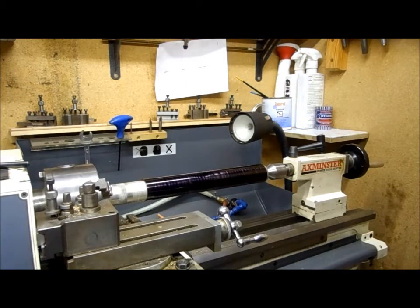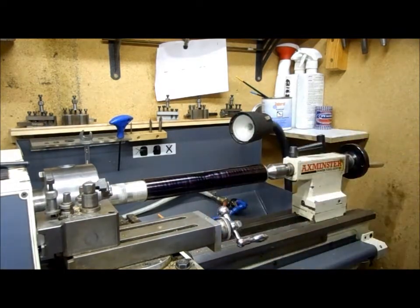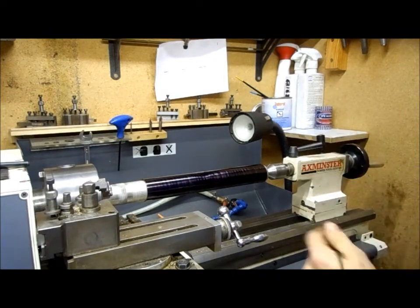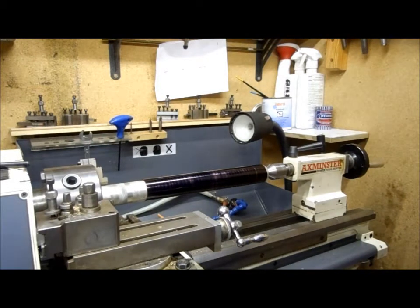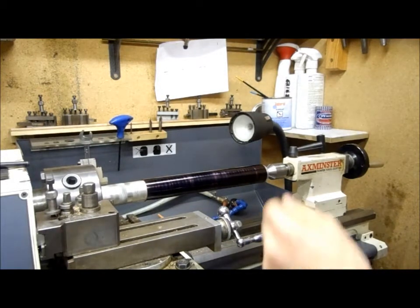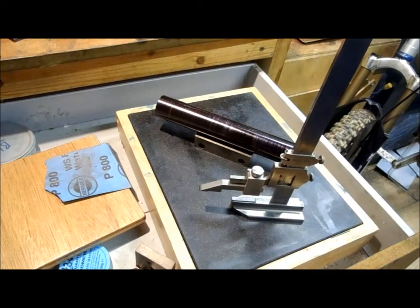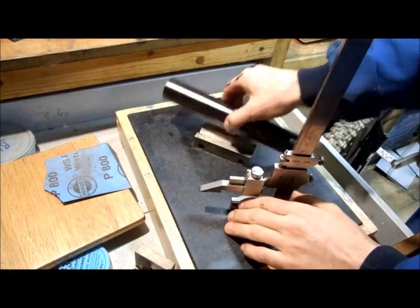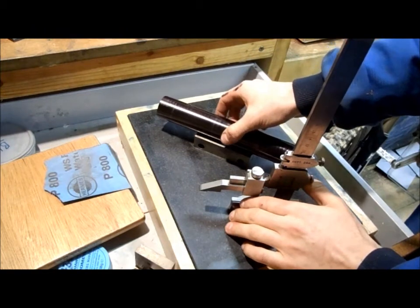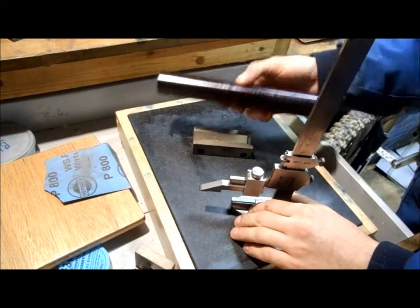Right, that's nice. Now I can mark where the holes are going to be from each hole. I can use spring dividers, but first I need straight lines. I'm going to put that in the V-block and use my scribing block to scribe the lines. So now I've just set up on my surface table. I could do with having two V-blocks, but I only have the one. So I'm just going to mark the centre lines.